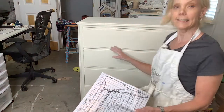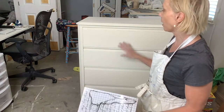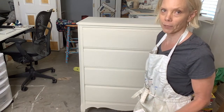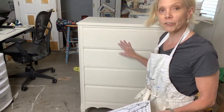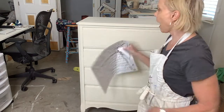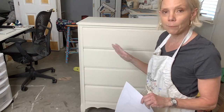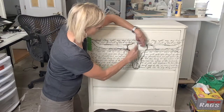When you are ready for this step, make sure that the surface is really dry and cured — the paint hard and dry, very smooth, and free of dust. If you put a finish on, let it dry 24 hours before you do this. Do not use a wax finish before you put the transfer on; the oil base will prevent it from sticking. Personally, I like to do it over very dry and hard paint and I typically have great results. I am going to tape these in place. This is the IOD Desperado Transfer, and then I can see what I want it to look like and move things around. IOD transfers come with gridded lines so you can easily line it up to make it straight.